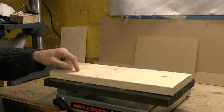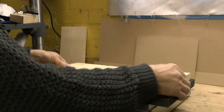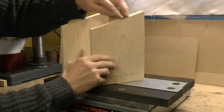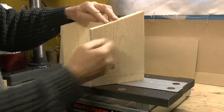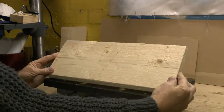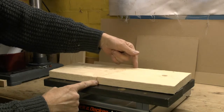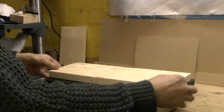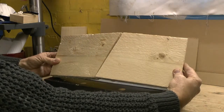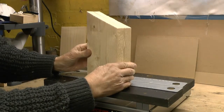This is how you cut the two sides out of the one piece that I cut from the plank. The piece I cut was 16 inches long, and that's because here we have the two sides which I've already cut. There's one, there's the other. That's the back of the bird box, this is the front. That back is 9 inches and this front is 7 inches. So that makes the 16 inches that we cut the plank. So now we've got a piece 16 inches, we're going to cut it into two. We measure 9 inches down the front side, 9 inches down the back side, put a mark there and a mark here, and then draw a line across between the two marks. That gives you the diagonal line, and when you cut that you end up with two pieces with a sloping top. When you put them together the opposite way, you've got two exactly the same which we use for the sides.